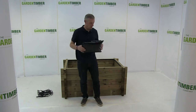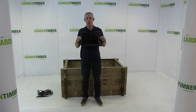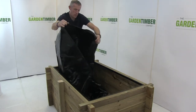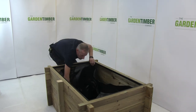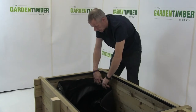We've installed the liner lock and the felt, and we're now ready to install the liner. Please note that the liner is made slightly smaller than the pond structure — this is because it stretches into place once filled with water and gives you a crease-free liner. For this stage you should take your shoes off if you're going to get inside the pond; if you are getting in, you need to be working in socks. The first stage is to open up the liner to the shape of the pond and make sure the corners of the floor line up with the corners in the walls. If you're doing an octagon, this is very important — otherwise you'll have to unclip the liner and work your way around again if it's twisted.